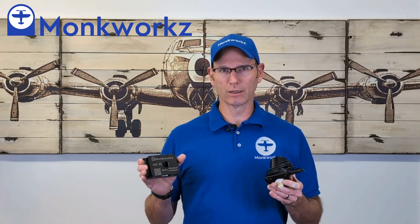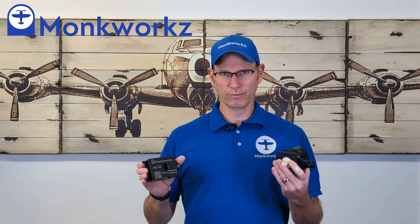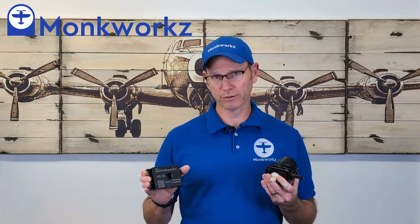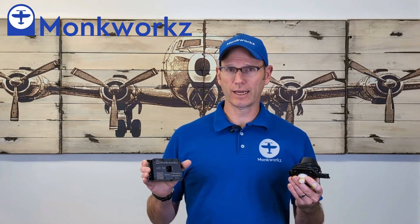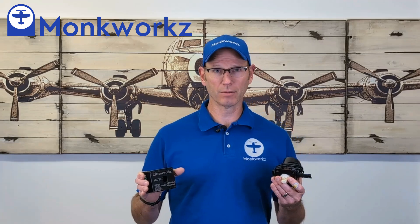Top of the list is that it's aware of what's going on around it. It's aware of the voltage of the bus it's attached to and how much current it's putting out. When attached to an existing electrical system with an alternator running the bus at 14.4 or 14.6 volts, this device will sit back and be completely passive. When the bus voltage slips below 13.7 volts, this device will step in and start putting out power. It'll let you know through a status indicator LED on your panel. When set for 14.3 volts in the recommended backup configuration, it'll try to maintain that voltage. If there's more demand for current than it can put out, it will flash the status LED on and off once a second, letting you know it's trying but not succeeding — you may want to load shed if you're expecting bus voltage to come back up to regulation.